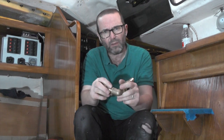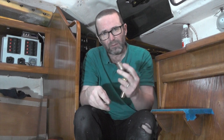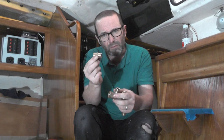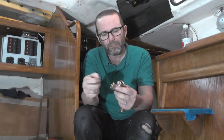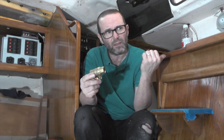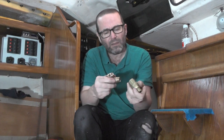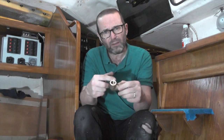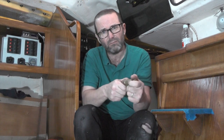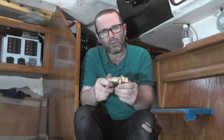I asked a question on the Practical Boat Owners forum, which is a very good resource. The question was: the nipple is a half-inch tapered thread, the same as that end of the ball valve — half-inch tapered thread — but this ball valve, as far as I'm aware, is just a straight-cut thread, and so is the hole I'm screwing this into in the sail drive leg. So I wondered if it's safe to put tapered fittings into non-tapered fittings. The consensus was yes, it's safe — more than safe, it's actually recommended. The people on the Practical Boat Owners forum put my mind at rest.